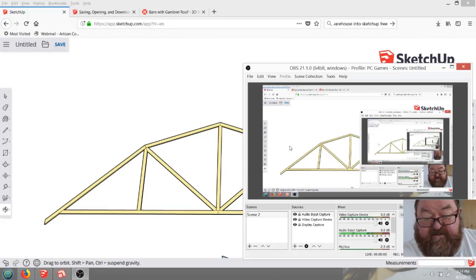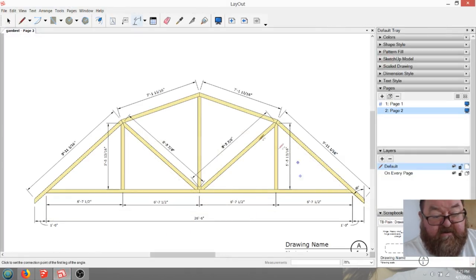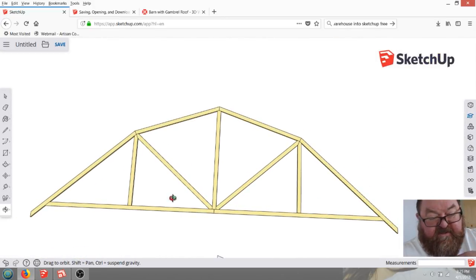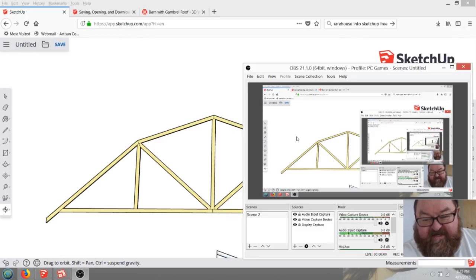The main thing I'm trying to get you to see is that if the drawing I send you with the dimensions doesn't tell you enough, you can go into SketchUp 3D Warehouse and get the actual model. Sorry this is a long drawn-out video. I was just trying to show Brian an idea on how to do a gambrel truss and how easy it could be. If you need more help Brian, just let me know. I'll email you the Layout drawing you can use for reference, and you can use the free version of SketchUp to rotate it around and see different views.